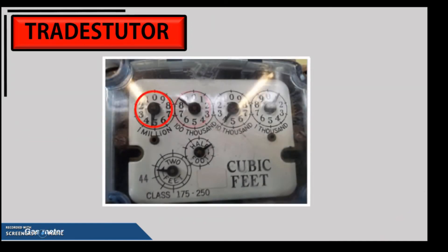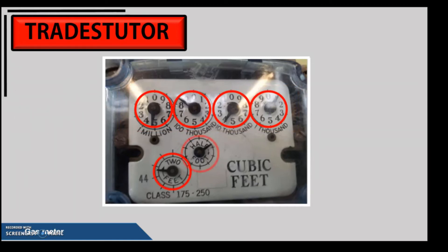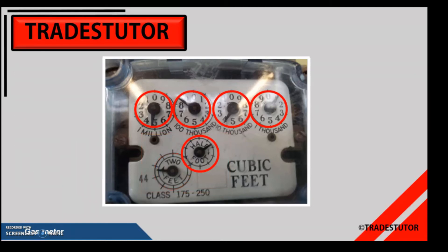Here's a bigger picture of the meter. The four top dials are the consumption dials, used by the gas utility company to measure how much consumption is going on in a particular building or area — that's not what we're dealing with. What we're dealing with are the two dials at the bottom: the test dials. One is a two cubic foot dial and the other is a half cubic foot dial. We use whichever one is moving at a good pace — not too fast or too slow.